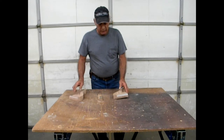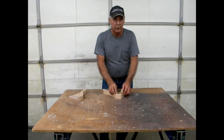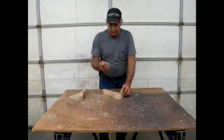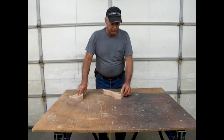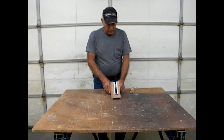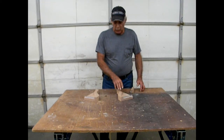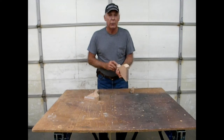We don't want to glue the halves together yet because keeping them apart lets me look at the geometry and placement of my components and figure out where the latch needs to be mounted. The latch has a single screw right in the center that will go through our glue seam, so it can't be added until after the corbel is glued up. I was able to mark the center line of the barrel so once it's together I know exactly where to put that screw on the inside. I'll now glue these two pieces up, secure this part of the latch, do a little clean-up on the corbel, and finish up.